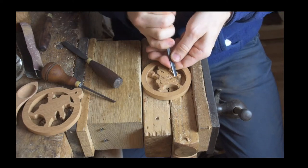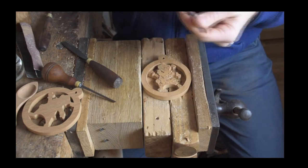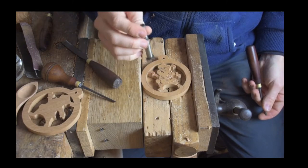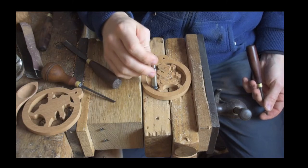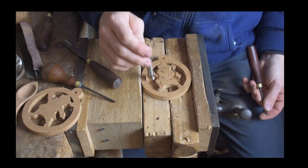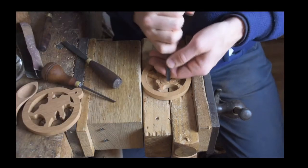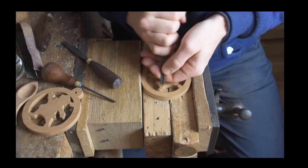It would have made my life easier earlier on in this demonstration, but I forgot. So basically what they were saying is to make life a little bit easier. We were doing a demonstration of cutting out the three wise men. Basically, if you use those cutters, because you've got a bigger hole before you start, it makes the scroll sawing easier. It can be a bit tight for that one there, but you can cut out using a cutter like those, and it just makes life a little bit easier for the scroll sawing. So another useful hint that somebody gave us, and we're passing on to yourselves.